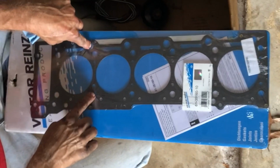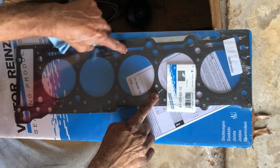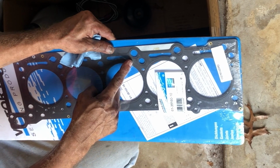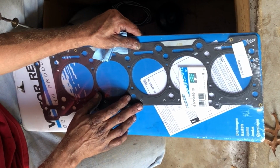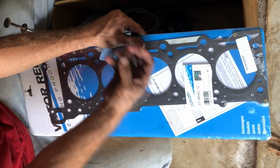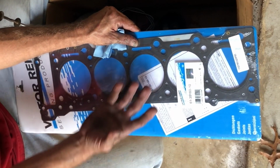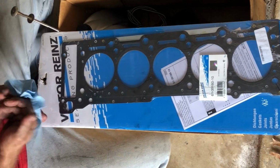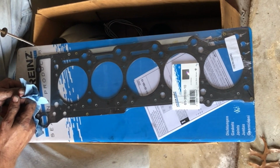So this is the way it sets. Bolt holes, bolt holes, bolt holes. Oil and block pressure. Coolant. So if this is 8 up here, every time that piston comes up, it's pushing air down into the block. And at the same time, every time it comes down, it's sucking air from the block. Oily, nasty, vaporous air. And then when the piston comes back up, it's pushing some of that air back into the block, some of that air out the top that we're seeing. That's a theory. It's a good theory. I like that theory.